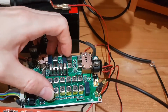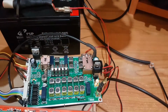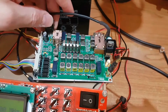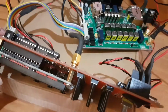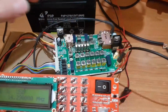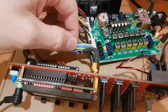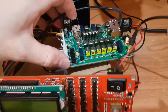This is the transmitting IF stage, so also the signal from IF mixer coming here and then into the output, into the TX connector, also is switching through the relay. The signal from DDS is coming here from this output with the coax cable here inside the DDS input in the board of my transceiver. And the controlling signals from DDS are coming from this also homemade cable and the optocouplers right here and also below the board.